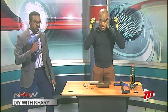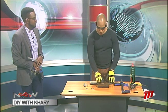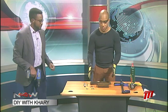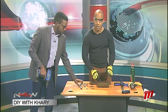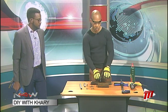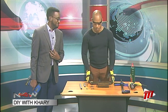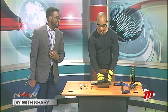All right. So I have my good friend Raucus to help me. I remember safety first. I have my gloves on. I'm going to protect my eyes as well as we keep it safe here in our studio. So as we proceed, now the first part which I skipped because I did it beforehand, you need to get a 220 grit sandpaper. Sand down your pieces. When you cut them, make sure they're nice and smooth. Then you could use the stain of your choice. In this case, I use dark walnut because I like how it looks. And let that dry for anywhere between 8 and 12 hours. Sometimes it may take more depending on how much you apply to your pieces, all right?